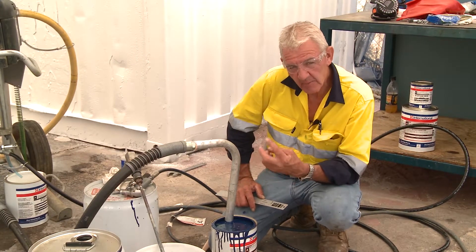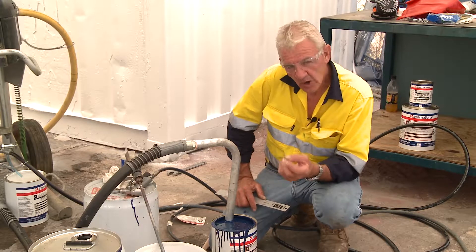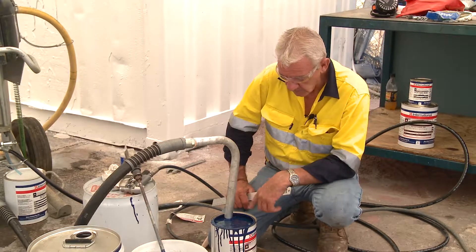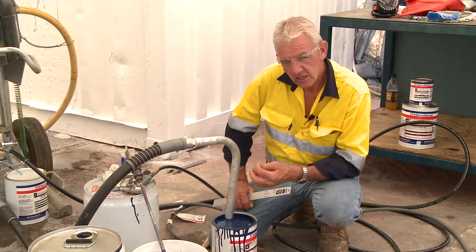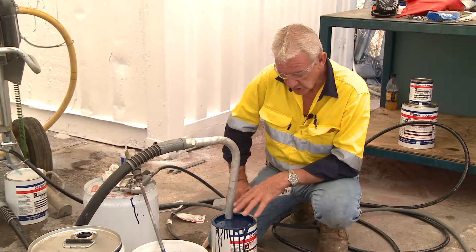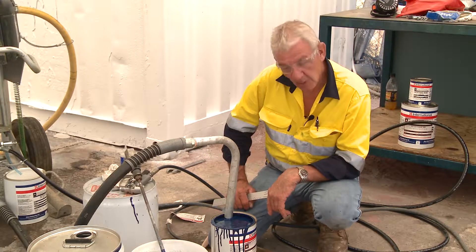Adding that solvent also makes it shinier because it's a top coat. So with most polyurethanes, you'll probably need to add a little bit of solvent. Now that I've reduced the viscosity of the product, I can come down in tip size. The reduction in tip size gives me a smaller, finer atomization. Most top coats have finely ground raw materials, so we can use finer tips and finer filters to accommodate that particular top coat.